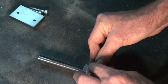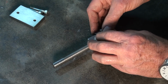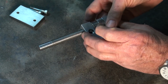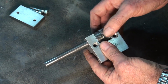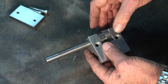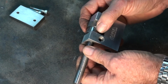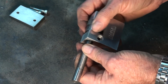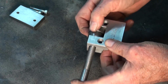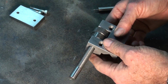into that hole and then a ball bearing, so that it just gives a bit of preload against that face. So just got to be a bit careful that nothing flies out here. So the ball bearing just pushes back, and that sort of just keeps a little bit of preload against that knurled face against this back edge of the stop. And then you just simply find the threaded hole and I won't bore you, but you can wind that all the way through.